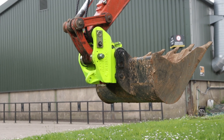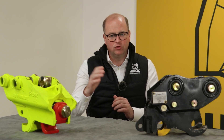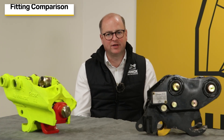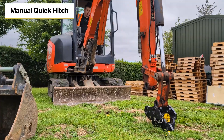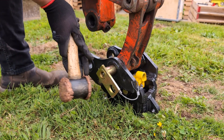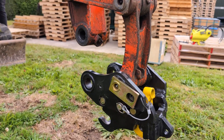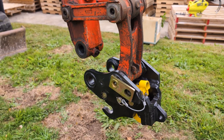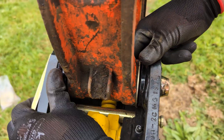Now let's work out what suits you best for your operation and your excavator. When it comes to fitting the Rhinox manual hitch, it's a lot easier and quicker to fit to your excavator, normally just taking a few minutes. All you need to do is remove the pins and line up the dipper end — it's really the same process as fitting a bucket to your excavator.